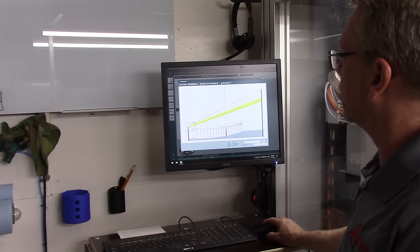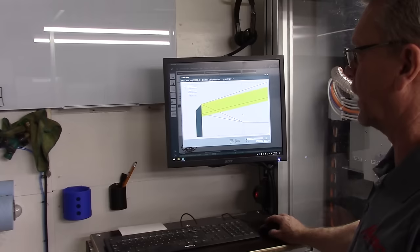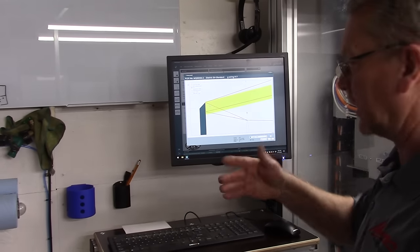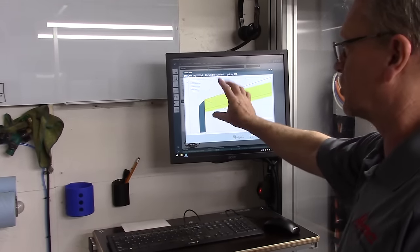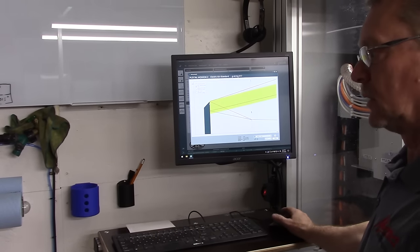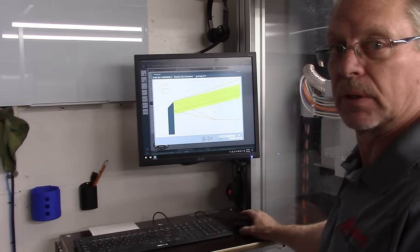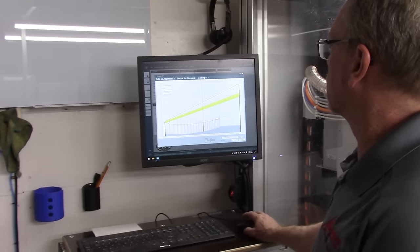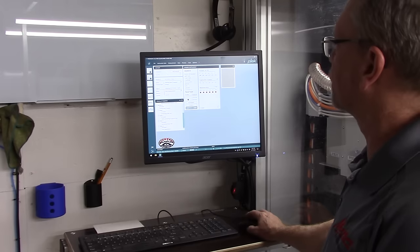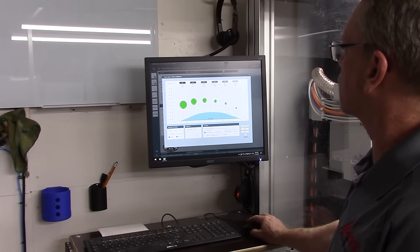But if we look down here at the nut, the nut is within that acceptable range. The nut slot depth is right at the top edge, but it's not even worth adjusting at that point, because again, we're talking about fractions of a millimeter, so small that it's not going to make a difference in the playability. Cool. So it's looking really good there, and that's just an adjustment we can do later. We could also kind of look at the action.